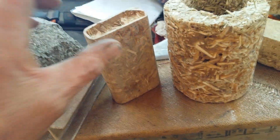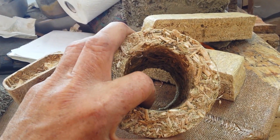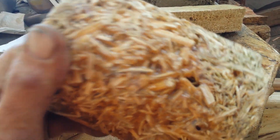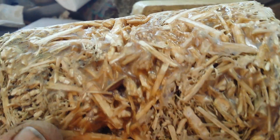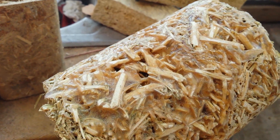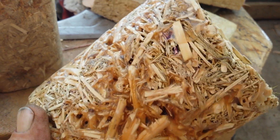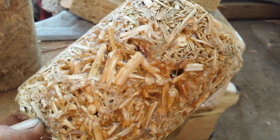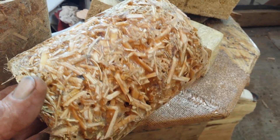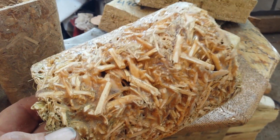This has a plastic test. This was purposely made hollow because I wanted to show off its castability. I really wish I could — this is where it's like, I couldn't see it outside at all, but now you can see it's like completely failed. It's not compacted, it's loose. There's a hole in here. I looked around on the inside — you can see two or three spots of daylight through them. The camera doesn't do it justice. It's a complete casting failure.